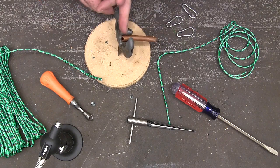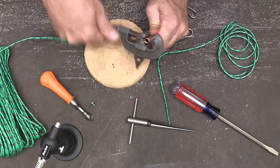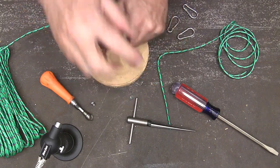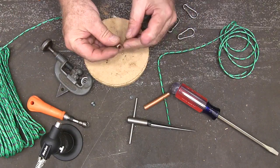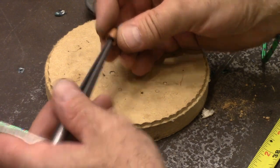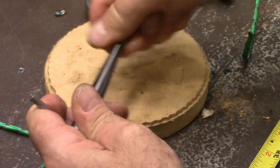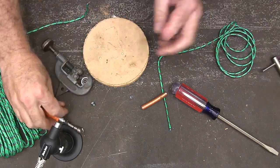I'm going to cut about 3/8ths of an inch off here — the length is not critical. Just keep tightening up the pipe cutter a little bit and go around and around. When you get that done, you've got that little burr. You cleaned it on one side, but you've got a burr on the other side too, so you just need to clean that off. You can use a screwdriver or just whatever you have.